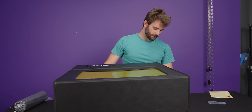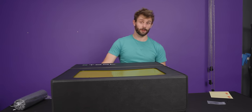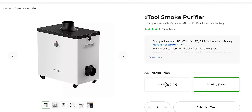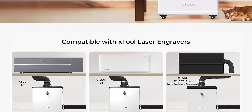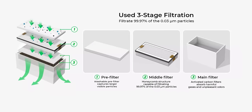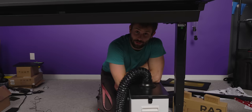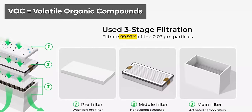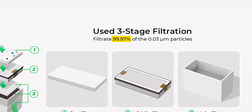You definitely still have to wear laser safety glasses when operating it. This fan can vent things out, but we also have a fume extractor underneath the table. This has several filters in it. Though it does appear as though it should filter out most of the particulate and VOCs, there is a chance that not all of the dangerous fumes will get filtered out. So venting the output outside is still a safer option.